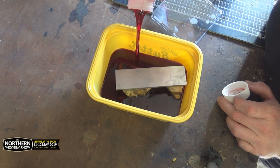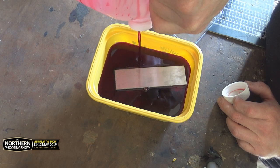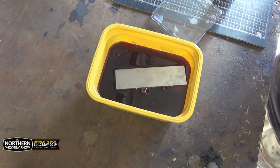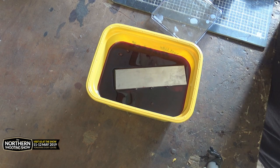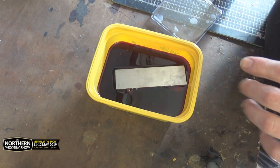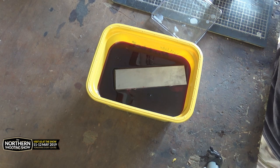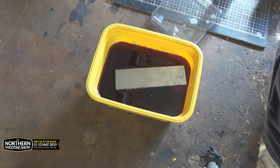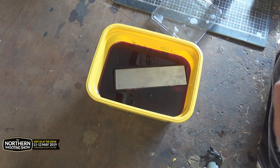Just hope I've got enough — it only just covers it. What I might need to do is put it into a smaller tub, just so I've got plenty of room above the block, so when it does expel all the air and draw in all the resin, the resin level will go down. The last thing I want is for it to go down below the level of the block. I've already got something running in the vacuum chamber, so I've got to wait for that to finish. Once that's done, I'll swap that over onto my heat treating oven or put it into my little toaster oven. Then I'll put this into the vacuum chamber, make sure I've got all the air out of it, draw the resin into it, and then this will be ready for baking.